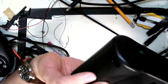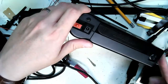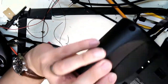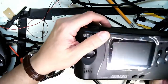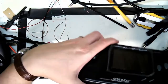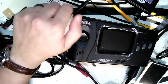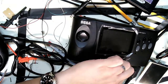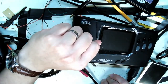I've already done videos on the battery packs, but I'm gonna finish those up tonight, charge those up and get them going. Then work on the CDX and try to get it done this weekend. I've got one screw I need to put back — I didn't bother putting the anti-tamper screw back in for now. I'll probably swap that out with a conventional Phillips. There's a lot of stuff in there, a lot of wires I had to fiddle with — wired up power from here to the 12-volt buck converter to the screen. All the wires for the controller 1 mod are hooked into the circuitry used for the conventional controls.